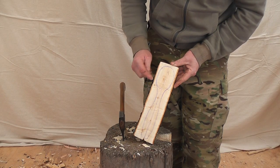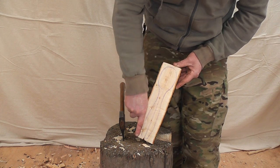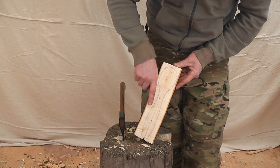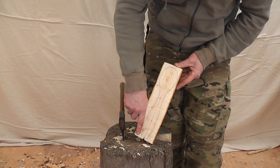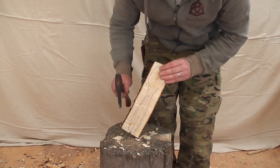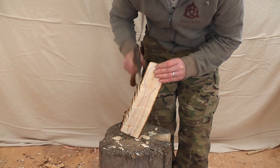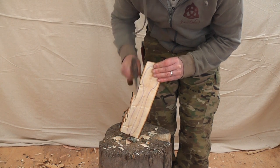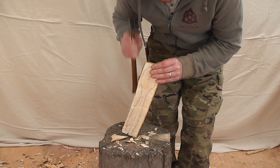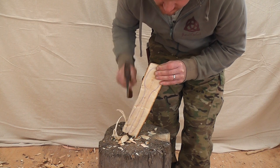But that's just going to give me something to aim at when I'm chopping. So the first cuts we're going to make are going to be working in this direction with the bowl at the top, and we're going to work off down the handle. This will make it a slight advantage because we can get rid of all this wood and the grain will be flowing in the right direction. So we'll place it slightly at an angle on the chopping block. With those nicks again, we can put a series of those nicks in all the way up. Careful when you get to the top for your fingers and for the bowl of the spoon. And you can slice down like this. Now it's entirely up to you how close you go to those pencil lines.